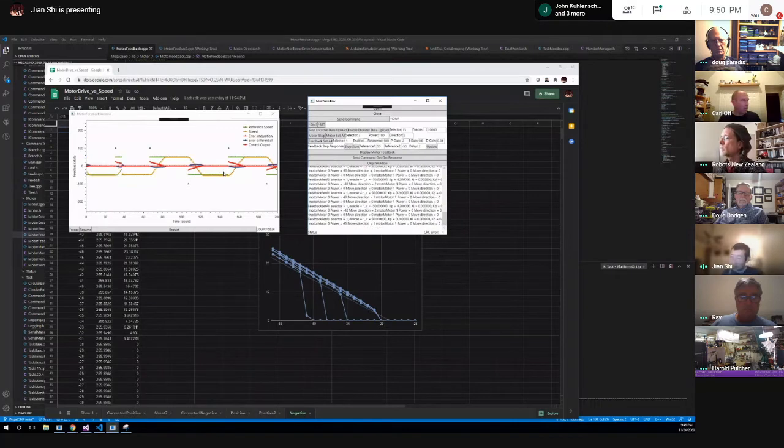Yeah, I'm thinking I will integrate the position. I have four wheels, four encoders. I have all the timing and position information. So I'm thinking to integrate the position, basically X, Y, and the rotation based on the position of the four wheels. And I'll command it to go, but I have a record of where it actually went. So yeah, that's what I'm thinking.